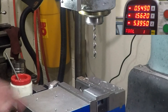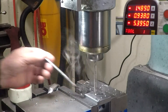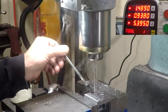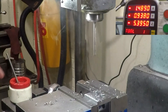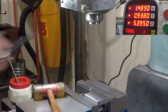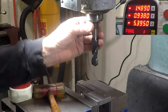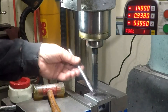Now for the pilot hole for the big hole — that is 1.489" and 0.938" to the middle. The first expansion is going to be the 39/64". And the other one will be just a 64th short of 7/8". Using the VFD to slow it down a little bit.